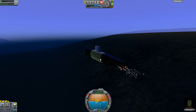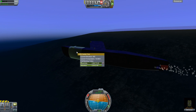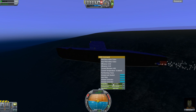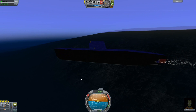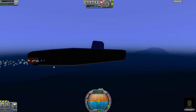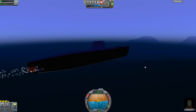We don't need to get that worried about the level of the sub in the water. So now we can do a full turn. If you add up the mass again — 22.73 in the tail and 5.88 in the forward compartment — that should not exceed or even come close to exceeding the amount of water ballast in the center of the sub. If you do it this way, you'll have perfect balance, and you'll be able to turn and climb and descend very easily. It becomes very balanced.